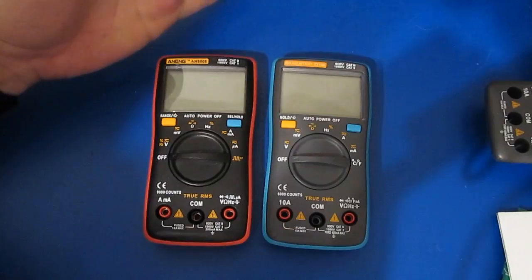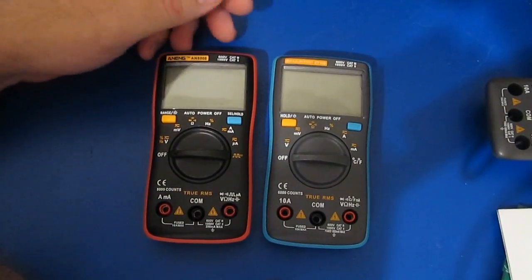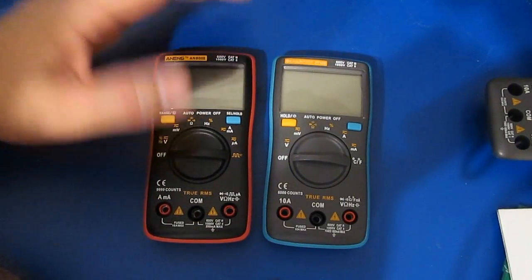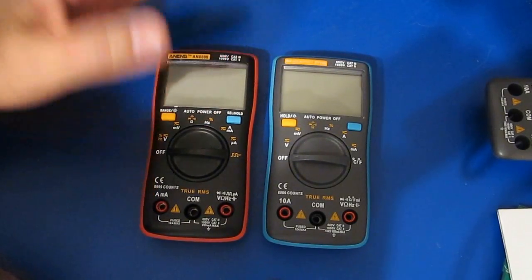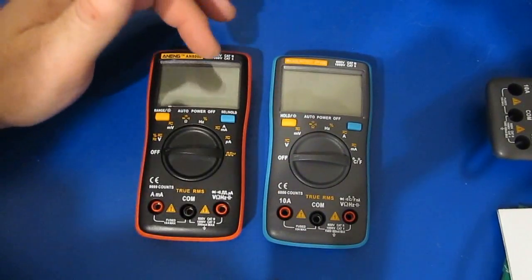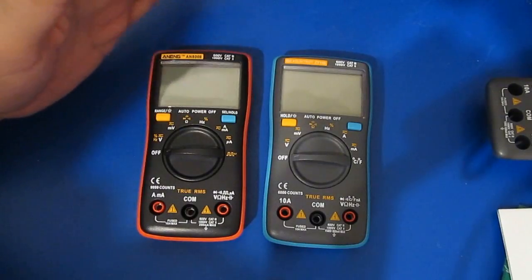One of the things that came out of that was the last video that I had made, where I was temperature testing the meter. I got a little bit of grief from Dave about running those tests, because of course I'm running them with a millivolt input, and he's running, I think, at like 4 volts or something, up on the volt range, where I'm down in the millivolt looking at the muck. And typically, with the meters I've looked at, I don't think I've seen one drift more than 2 millivolts, even with all the test leads in there. I'm not saying we're not having some kind of thermocouple effects with my cabling and such, but most of that's going to get canceled out when I run it anyway.